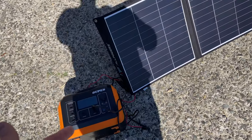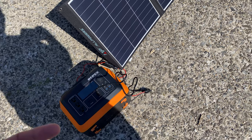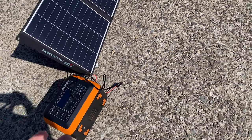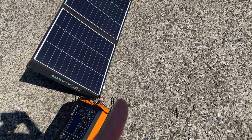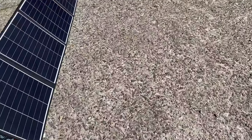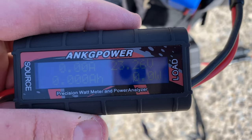What I need to do to continue this test is bring a voltmeter and check the actual open circuit voltage — to prove that it's going to say 23.5, and then when connected to the solar panel it's going to drop down to about 20 volts. I also have a charge controller that's up to 20 amps both ways, so technically it would be able to handle this 200-watt panel. The sun is slightly hazy but almost a clear day — pretty close to optimal conditions. Open circuit voltage is actually 23.5 — I've seen it as high as that.